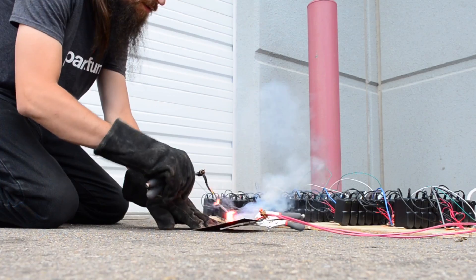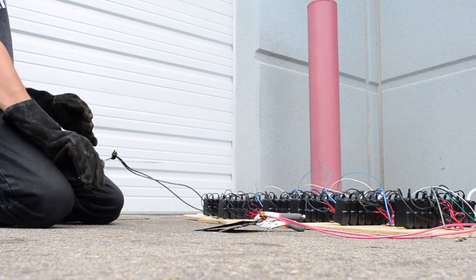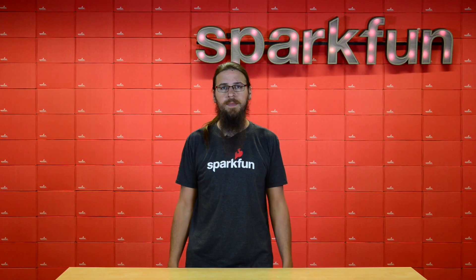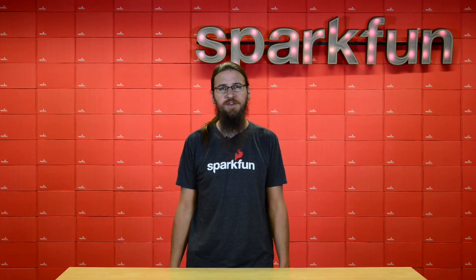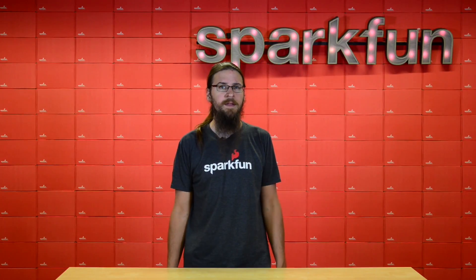As for the sparklers, I was hoping the extra energy emitted by the sparkler would help the welding process, but it just stuck to the workpiece and got hot enough to light the coating from both ends. I think that's enough abuse for my poor power supplies. I'm not sure what I'll do with them next, but it's been fun to hook them up and try and figure out what's required to sustain an arc for welding. Thanks for watching!